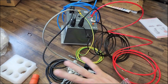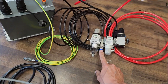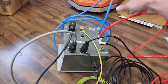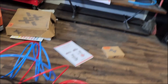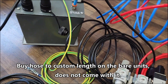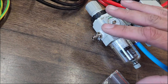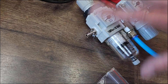Your main air is gonna come down to your regulator and go in there. With the master guns the hose is already connected; with these you're probably gonna have to cut some hose and use it — I believe they are the same eight millimeter as your red and your blue. You're not gonna need all of this depending on how you have your pump set up, so I'm just gonna cut a little bit off. Push it in there and then push it in to the bottom. These guns all come with a fitting — take it out and put whatever fitting your whole shop is set up with.